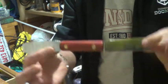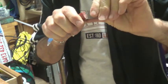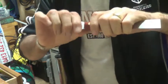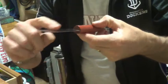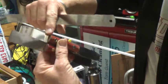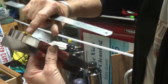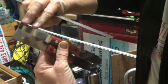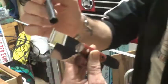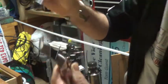With the end cut off, now just simply and easily straighten these out. It's not super strong, so it's very easy to straighten out. Next we'll get on to making this curve. So choose your height that you want to come up. I'm going to be coming up approximately 35 millimetres to the first kink, which I'll kink out. And then we'll take a 12 millimetre radius tubing here to curve this around to get your radius roughly 12 millimetres.